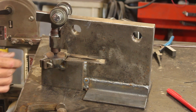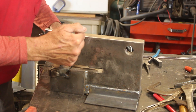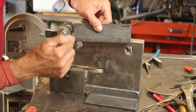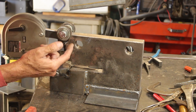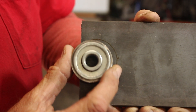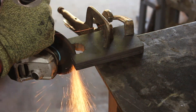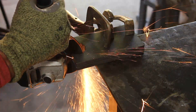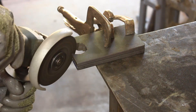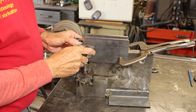Here's what I've come up with so far — I'm fairly certain that's going to work. We're pretty close to punching a hole in some metal. But there's just a tiny corner of contact area between the bearing mount and the frame, so I'm going to make a couple of gussets to weld onto the frame and connect the bearing mount to it. I've drawn a circle on this 3/8-inch plate and I'm going to grind that out — I've got two of them. I spent quite a bit of time on the bandsaw cutting out as much material as I could, and now I'm coming in with a grinder to make it round and fit the bearing mount into it.